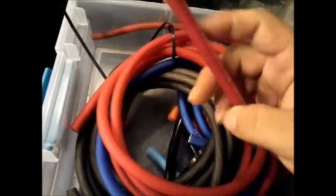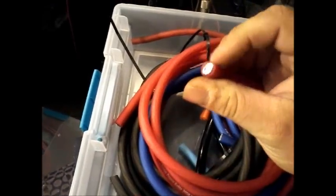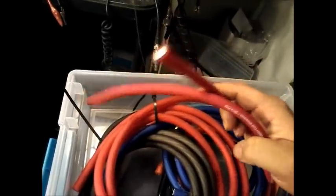When I first was purchasing from this company, before I spent a couple of $100, I ordered this wire, and another wire of the OFC of the same length, and just checked them out and seen how each one did. And I quickly figured out that this aluminum clad is junk. I really should throw this away, but it's okay to use with stuff that you're going to be crimping to or something like that. And it also doesn't hold as much current as OFC does. But basically, this stuff does not solder worth a hoot. It is not fun at all soldering with this.